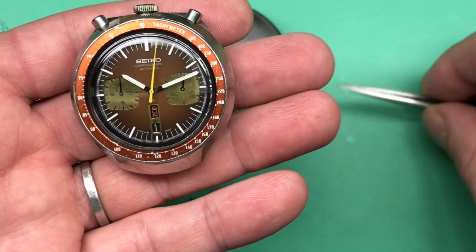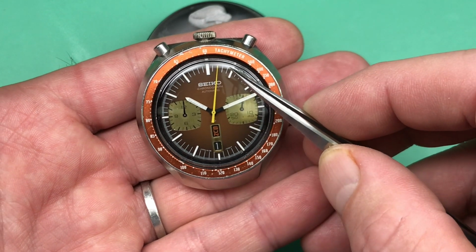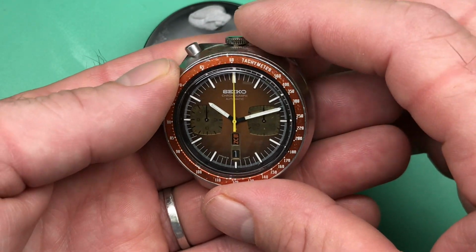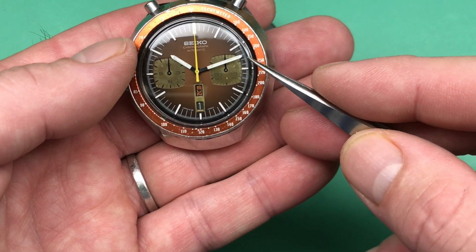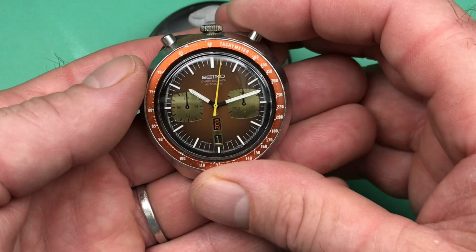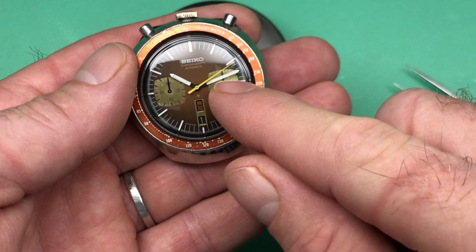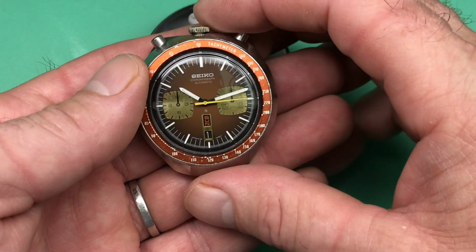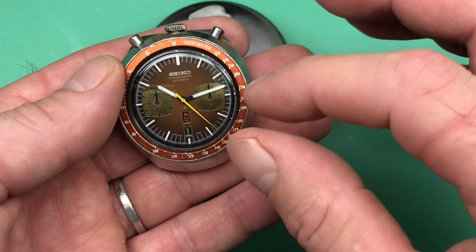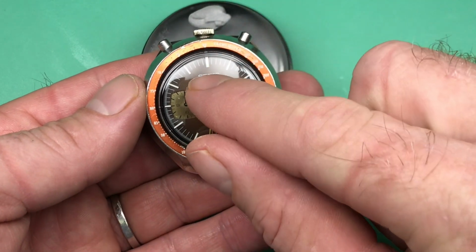I want to give you a little bit of a tip on resetting. I always reset my chronograph back to the zero position somewhere between 11 and 1. It's only there to help preserve the chronograph. It's a thing with these watches, especially with the white painted hand watches. If the minute hand is between the chronograph and vertical, then if it's a hard reset from way down here and it goes past this hand, there can be flexure in this chronograph hand and it can actually hit your minute hand and cause a nick. And a lot of times you'll see these that they've actually cracked some of the paint on these hands. And for that reason alone, I'd say, try and get it as close to midnight as possible on the reset.